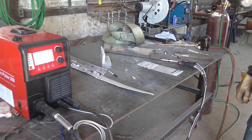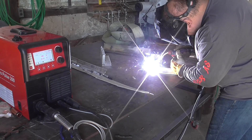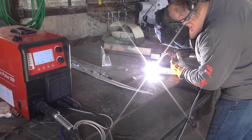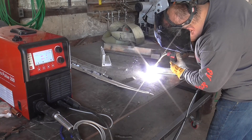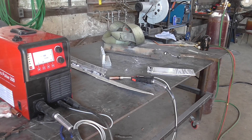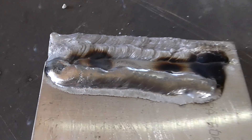It works pretty perfect — fills the crater, everything. We're going to go one more time on really thick, cold material. Running it wide open for a lot of hot start, then tapering down a little bit and filling the crater really nice at the end. Now let's take a look at how that weld looks. From what I remember, it looks pretty good — hardly any soot, a little bit of gun angle there, no cold start, the crater is nice and filled with no cracks. A little bit wide of a weld — I was overdoing it a little.